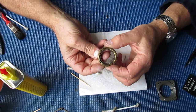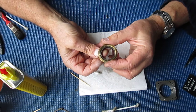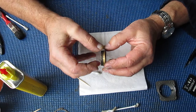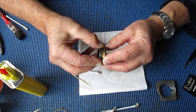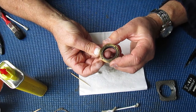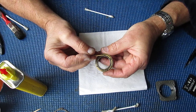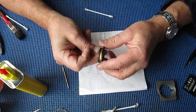It hardly shows. You can see that they are not up to the surface, so I've got to rotate that one position, bring it back round. It's still below the surface on the inner. Rotate it back one more position, drop it back into the thread, wind it up, still below the surface, one more. Where are we now? Okay. Alright. So now, when the front surfaces are level, that line lines up there. These two lines, the one that you can't really see there by that hole, they line up there. Now that is the correct alignment for those two components.